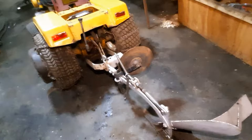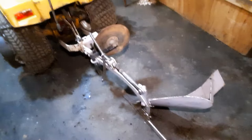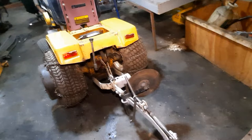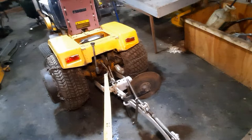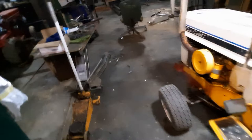This 149 with all its weight - nothing in the tires but air - will pull hard enough to bend the whole plow frame. There's a lot to setting up these plows. For the hitch adjustment: put your hitch all the way down, take the pin out, let it all the way down, then put your pin back in. When you get off the block you should be able to pick the tip of your plow just off the ground.